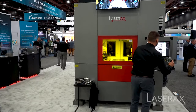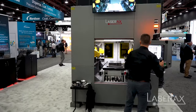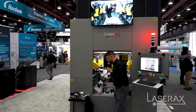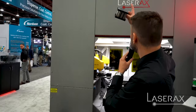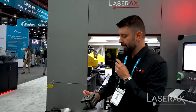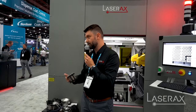I'm going to open the machine. What we have today is a mini module made from 21700 cells, as I mentioned earlier. You'll see a video feed on top here, and the interface will give you some information too. First, the machine performs vision imaging of an area of cells up to 400 by 400 millimeters, analyzing all zones to detect each cell's position.